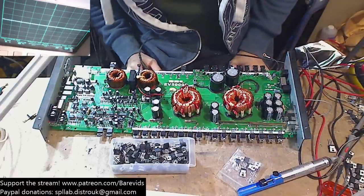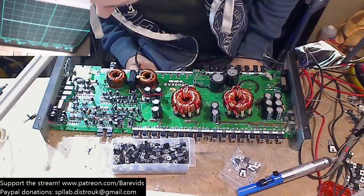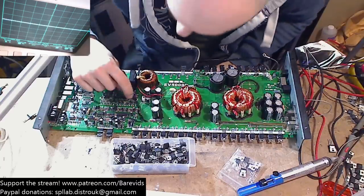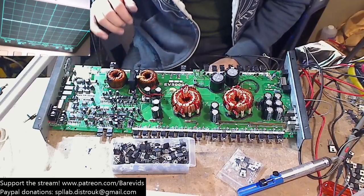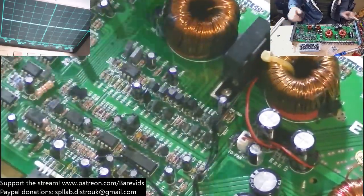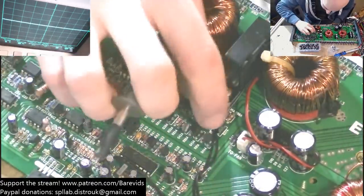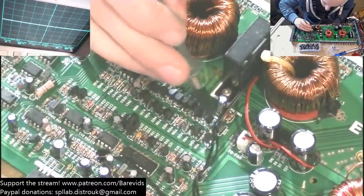So it looks like we have drive circuit failure then, of both high side and low side perhaps. Something's not happy. So what I'm probably going to have to do is order some, you know, it makes sense to just refresh the whole of these to save there being any issues. It makes sense with these older style Class Ds, they're very fussy and very picky. I'm probably going to go ahead and literally just order original parts for these and replace all these driver transistors.